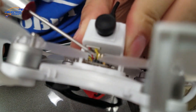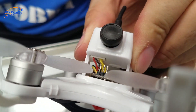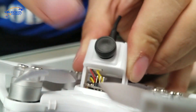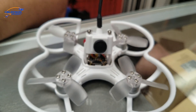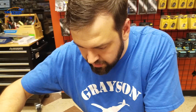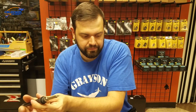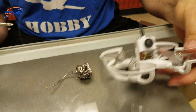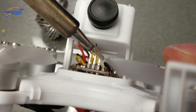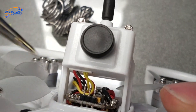A little flux again, and I'm going to put it on the three solder pads — the three pins here. Get the props out of the way; you may want to remove the props if you're not great with a soldering iron or don't want to melt them. So I'm going to tin it, tin it, and tin it. That was quick — doesn't take much.